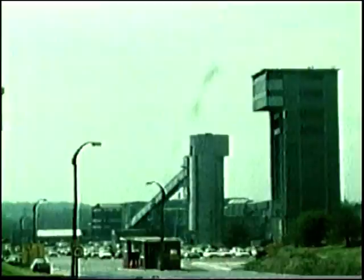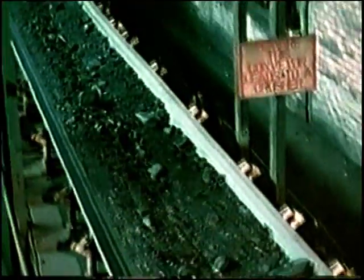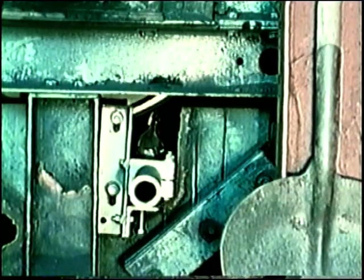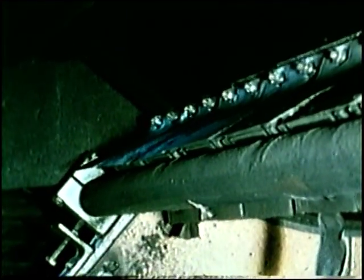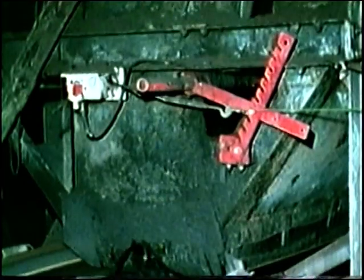In the coal industry, much of the material carried is fines. This conveyor leads to a crusher plant. The R-type scraper is designed for reversing belts. Raw coal feeds into the crusher plant, and on this belt the R-type cleaner is continually removing carryback material, which includes hard rock mixed in with the coal. From fines to wet-graded coal, these scrapers are designed to withstand continuous harsh working conditions, cleaning slurry from the belt.